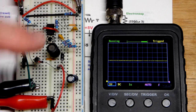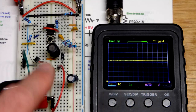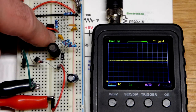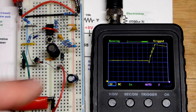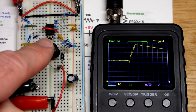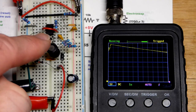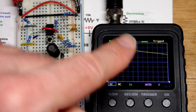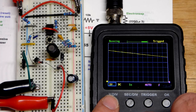Here we have a simple voltage booster - not a very good one. We're a little below five volts because of the diode drop. When I press the switch, the 555 timer goes to astable mode, the transistor turns on and off, we charge the inductor by getting current going through it, and when we cut the power it pumps that current into the capacitor, raising the voltage. It goes very slow.